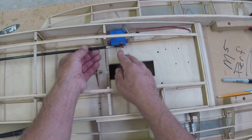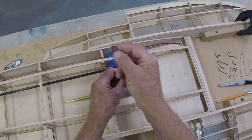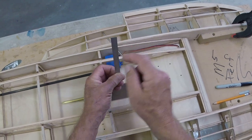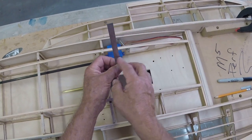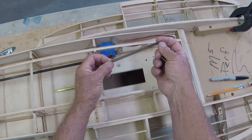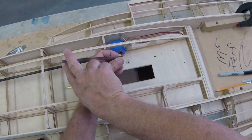The most reliable in distance. Oh boy, that's a terrible way to say it. Let me think. Because of the arc of the servo arm, right up here at 90, this is pretty reliable, right? I get a certain distance for a certain number of degrees, let's say. Once you're down here, it's not the same. You're not getting that distance travel. See what I mean? You're getting up and down, and same is true over here.